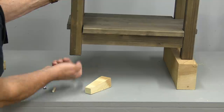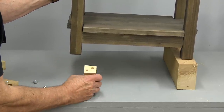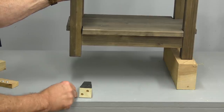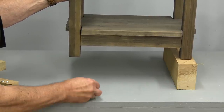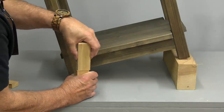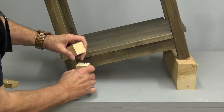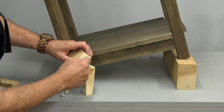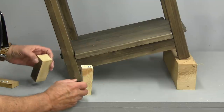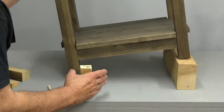Typically what we do is drill a couple of holes in the main part of the leg so we can put at least a couple of dowels in. The way we find where those dowels fit is we use something called dowel finders. They go into the hole where the dowel will sit, and when you press another piece of wood on top, it leaves a little indentation that helps you align the dowel to that hole. You drill the hole for the dowel, put the next dowel in, and find the second hole quite easily. It's a great little system — dowels will hold that leg very rigidly in most cases.